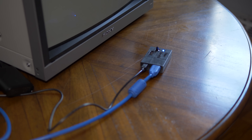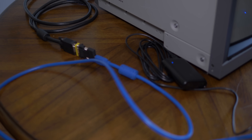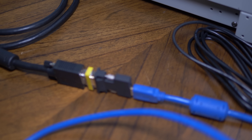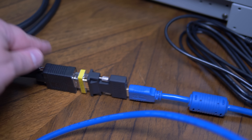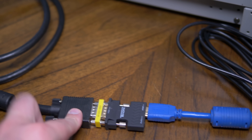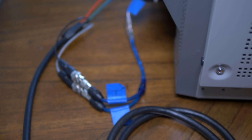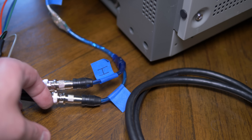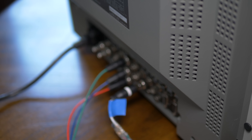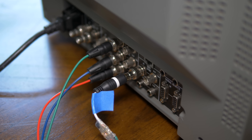To perform these tests, we'll be using a TimeSleuth lag testing device configured to output 240p and 480i — the same signals most classic consoles output. I'll then be running it through a digital-to-analog converter, or DAC, to convert the HDMI signal to RGBHV. We'll use a 5BNC cable to break out RGB to be plugged directly into the monitor, then use a passive sync combiner Steve from HD Retrovision built for me to safely combine H&V sync into C-Sync. As a note, never use a basic Y cable to combine sync — always use some kind of sync combiner device.